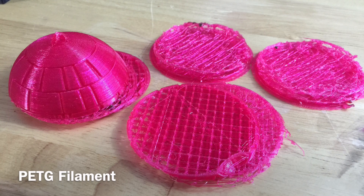I've been asked to try out PETG filament, and I found some at the Micro Center in a really cool translucent reddish-pinkish color. This would have looked great for the ornament, but I couldn't get it to print properly — it was really sticky, sticking to the nozzle, and it actually caused the print to shift. I tried it on the Fabricator Mini and the reflashed Da Vinci, and it was just coming out stringy. Neither one really worked perfectly.